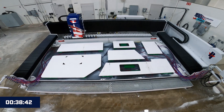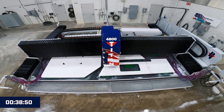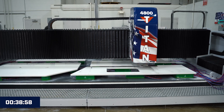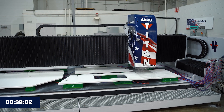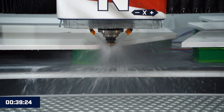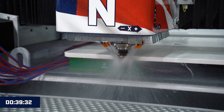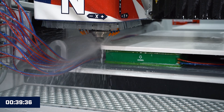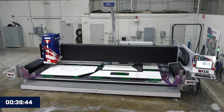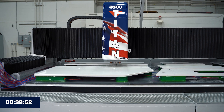We're about to see the first of two high-speed tools coming up next. Typically in a tool set they all run fast, but your fastest tools are going to be position two and position three. Let's slow it down a little bit so you can see what it looks like in real time. We're running at 350 inches a minute on positions two and three. On earlier versions of the Titan I've seen this machine go up to 1,000 inches a minute on some profile tools. The Titan 4000 series is built to meet high-speed tooling as it evolves in the future. It's got a rigid build to give you less risk of vibration and offers plenty of water at the spindle to cool down your tools. The Titan 4800 has a whopping 8 by 16 work area — the largest in the industry — with a 25% reduced footprint. This large table allows us to do this 85 square foot job.